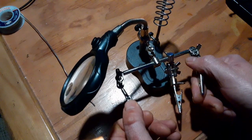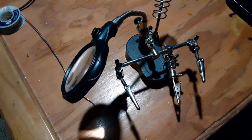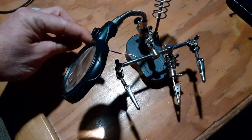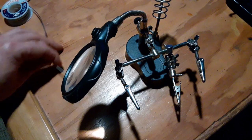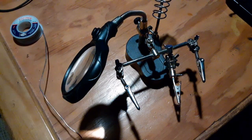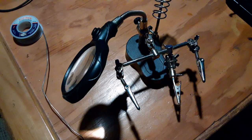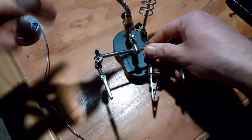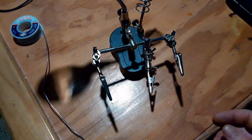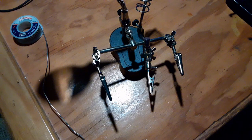One of the main things with solder is you never want to place anything with solder. You never use the solder to try and push stuff into place. It needs to be held into place and staying there, and then the solder sits on top of it once it's already in place, just to permanently lock it. So something to hold it. This little Helping Hands tool here. So we'll mount the board here and get started soldering.